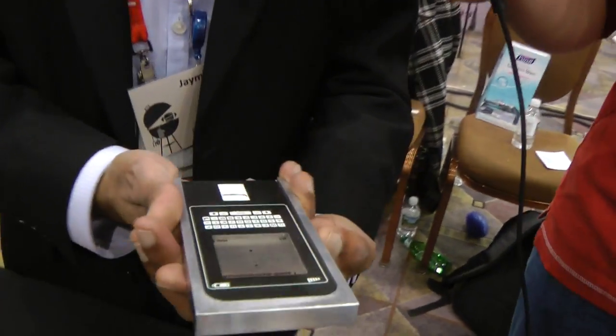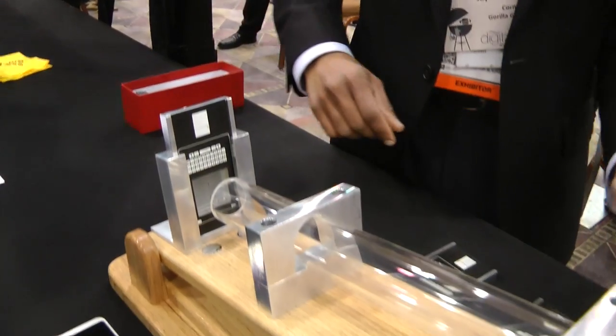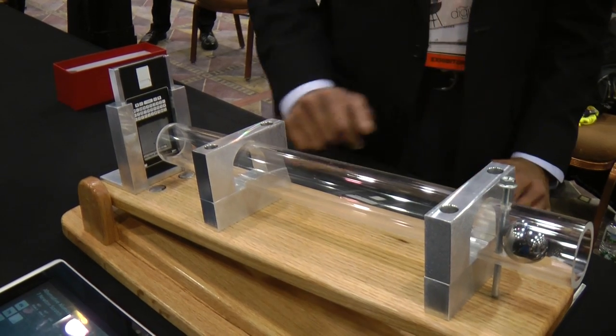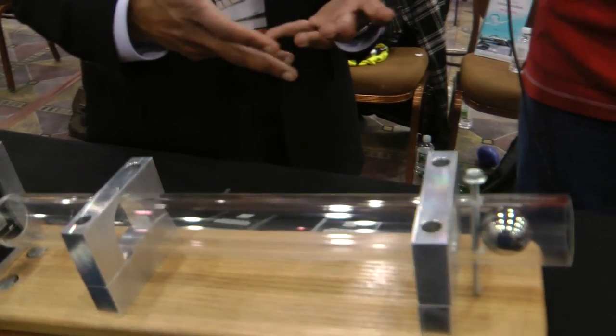To do the demo here, we've got a competitor glass with a 7 Newton scratch — you can just about see the scratch on that piece of glass in the center. We're going to put that in this fixture and drop a ball. This is an incline plane demo at 10 degrees. The ball is a 130 gram stainless steel ball — it's an industry standard ball used for testing glass.